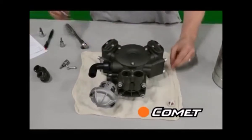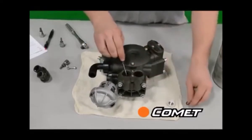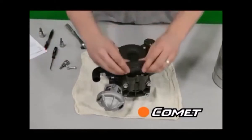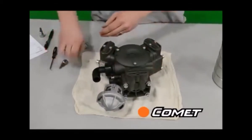Pull the o-rings using an o-ring puller. Once you've inspected, cleaned, and/or replaced the valves, put them back in the pump the same way they were. Most pumps have a system that prevents you from putting the valves in backwards.